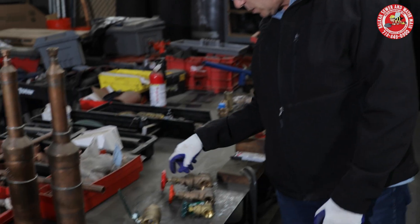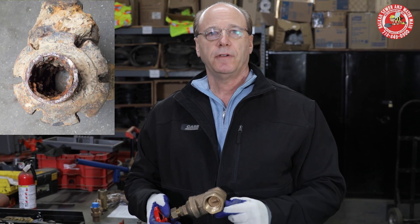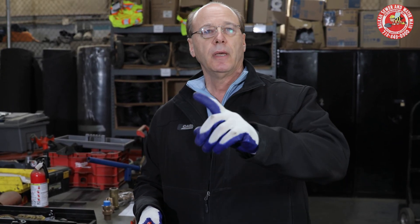Here's another thing: when you want to close the water and you think your valve is closed, open a faucet and make sure it's closed. Don't just count the turns and end up with a flooding situation. Likewise, if you know you're supposed to have about six turns and you only got four, open a faucet and work the valve back and forth — because if there's corrosion in the valve, you can frequently break it loose. It'll come out of your faucet, so take off the screen or aerator. The corrosion will come out and then you get a full closure.